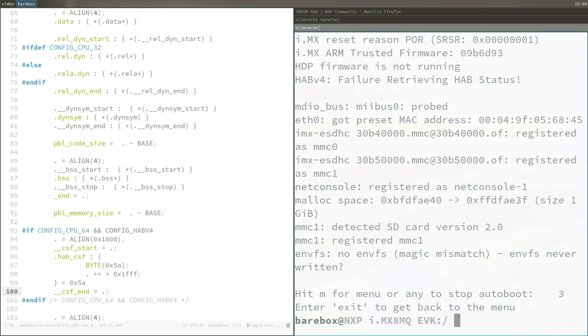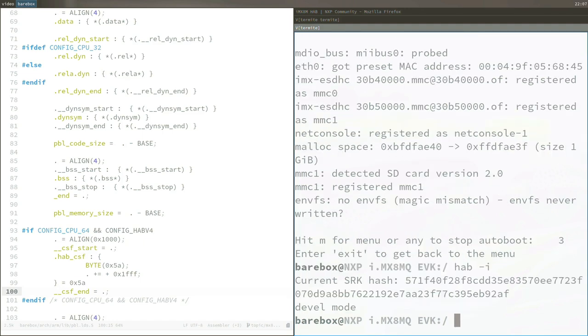Regarding the point of this exercise: the board is not yet locked, so even if the verification does not succeed, the board will continue to boot — that's open mode. The board has been flashed with the correct hash and does all the verification magic, but it's still in development mode, not production mode. I want to complete the whole exercise of creating the image and verification before finally locking the board, because if something goes wrong when locked, the board just won't start — and you'd have a dead piece of electronics that costs $500 to acquire. I also need to sort out the warning before locking.